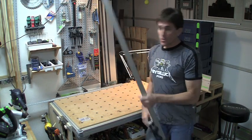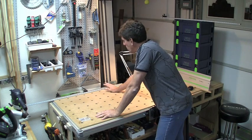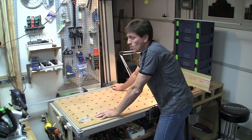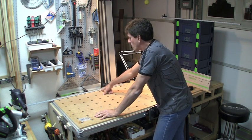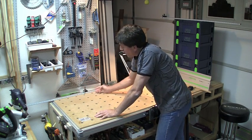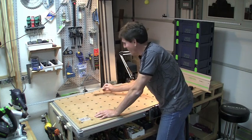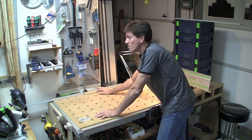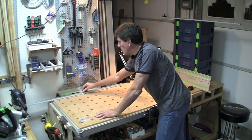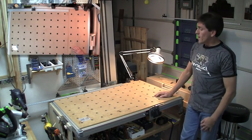So this is a fence that you would normally use. The fence system itself normally doesn't have a tape — that's something I'm going to cover in my video because I do this tape in a special way for recalibration. It normally has no tape. It has these little flag stops on them, so it's just a little flag that will come down so you can butt some wood up to it for repeated cuts. Now, I keep saying cuts, but I haven't discussed where I'd be cutting on this tabletop. This tabletop is a sacrificial top — you can see there's a kerf mark here that I've made from repeated cross cuts. Some people have just completely decimated tables, just kerfs everywhere.